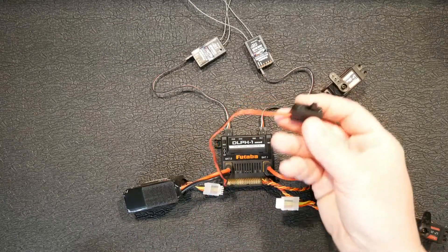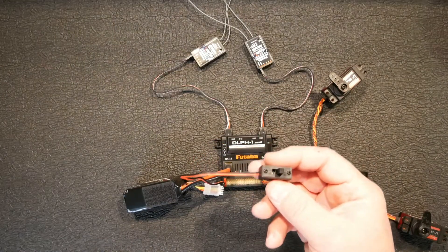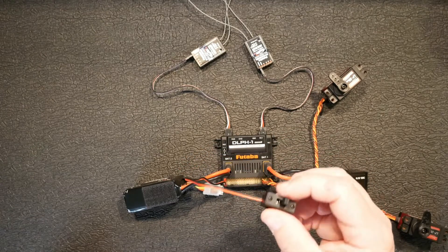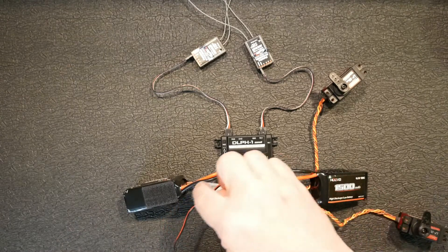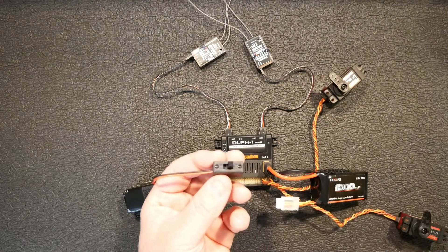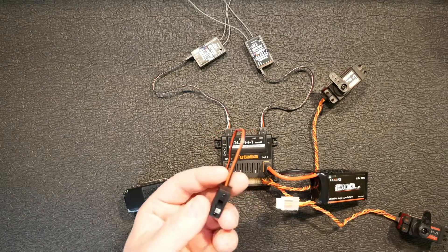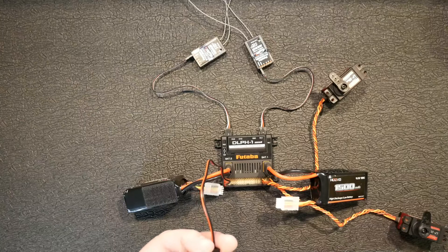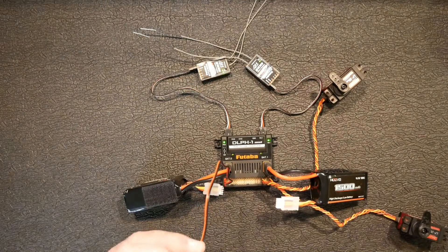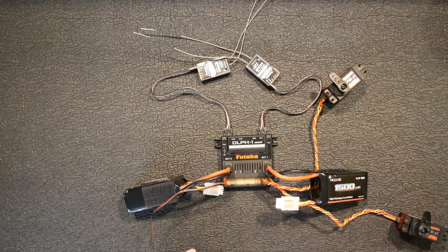It also has one single e-switch — and if you saw my rant video about why FrSky didn't supply one of these on their R10 Pro — this e-switch controls the whole situation. Instead of running two switches, one for each battery and into the radio, this one electronic switch controls everything. Whenever you turn it on, you can see the green lights come on and everything works. An e-switch is what they call a soft switch, so if it fails, it's going to fail to the 'on' mode.